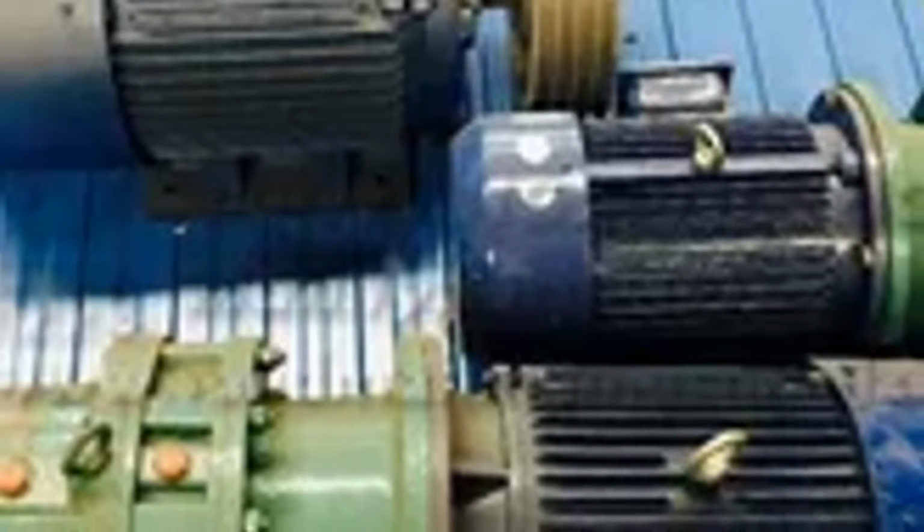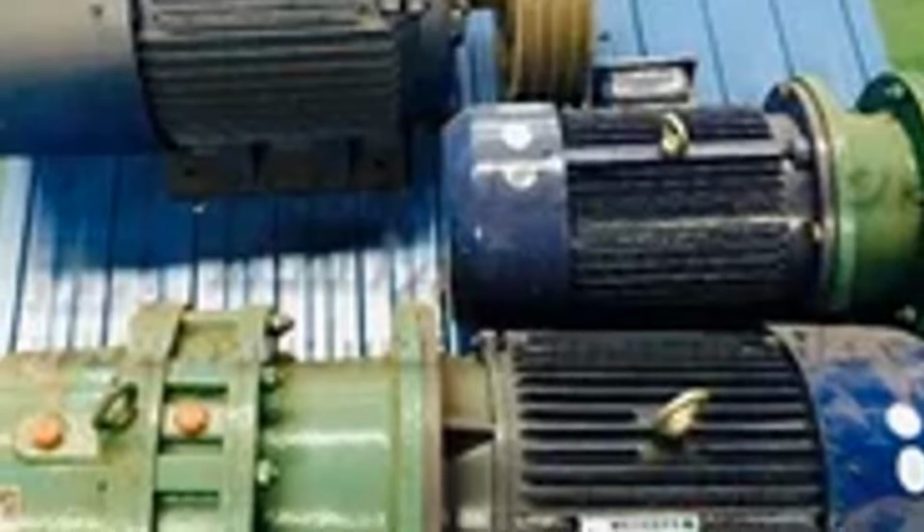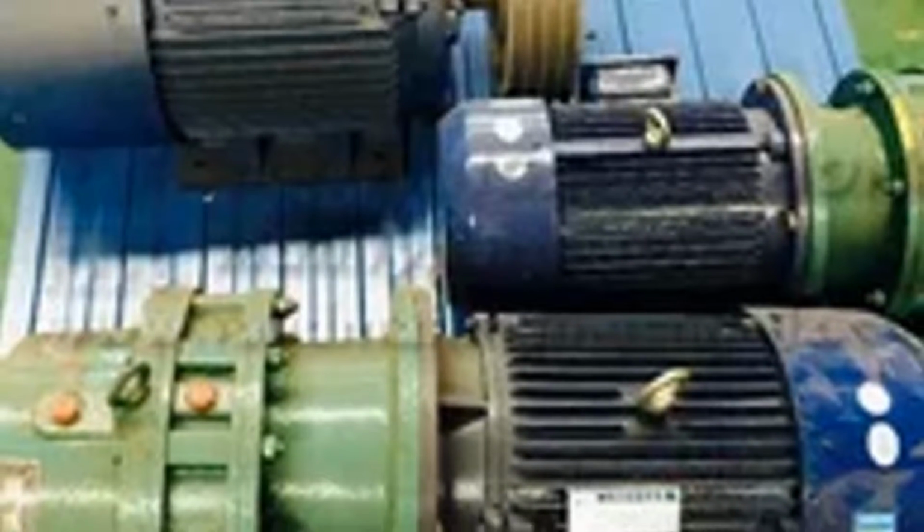The field current may be supplied from an externally controlled rectifier through slip rings, or, in larger motors, it may be provided by a shaft-mounted rectifier with a rotating transformer or generator. A synchronous motor with only a field winding carrying a direct current would not be self-starting. At any speed other than synchronous speed, its rotor would experience an oscillating torque of zero average value as the rotating magnetic field repeatedly passes the slower-moving rotor.